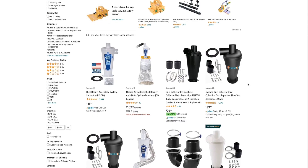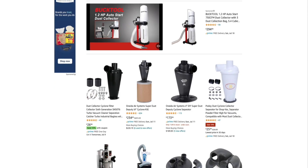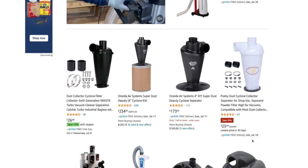These systems are really the best but they're expensive, require a lot more power, and take up a lot of space. So if you're a beginner, starting with a single stage dust collector and moving up from there might be the best option. They do make a cyclone attachment for a single stage dust collector to make it a two-stage system. These work pretty well at separating fine from heavier particles, but they don't increase the overall power of your machine and they actually decrease the volume of air.